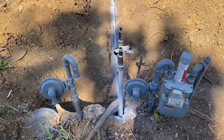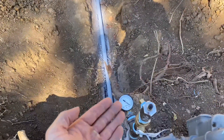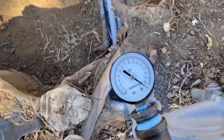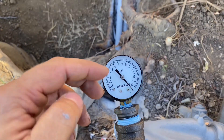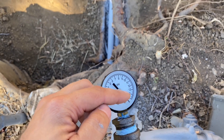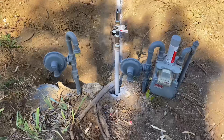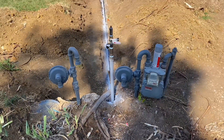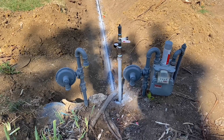There are no leaks and you've pressure tested it for at least 24 hours. If it drops due to temperature but comes back up to 15, that's fine. Right now it's well above 15 because it's getting hot out — the sun is on the pipes. At nighttime it'll go back down to 13 or 14 and then back up again. It should never go all the way down. 48 hours is more than enough — the gas company only checks for about 15 minutes, so we're way good here.